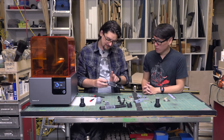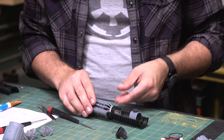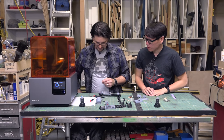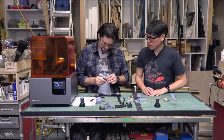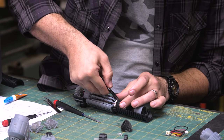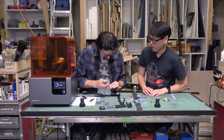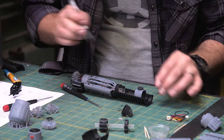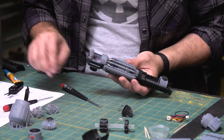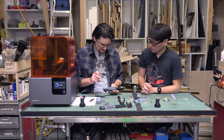Got it. So basically now that screw is holding this whole assembly in place and the other end's held up here. So what we're gonna do is, I didn't bring my X-Acto knife, but I happen to have my scissors. We're gonna cut the rubber band. There we go. So now we have, that's just friction fit at the top there, okay. And if you want, you could print the wire tube as something opaque if you didn't want to see the wires at all.